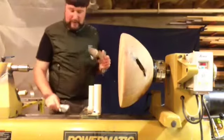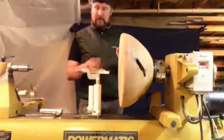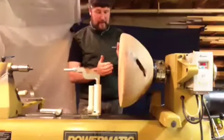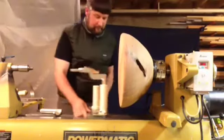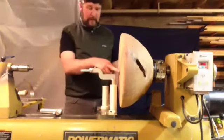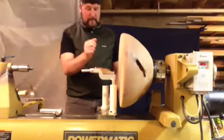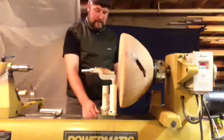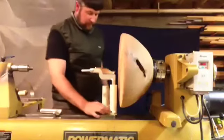So generally, since you have a sturdy tenon, it's best to start coring out the smaller bowls first, and the largest bowl last. What I've been doing is putting a 5/16 for the worm screw, so that when I get the center out, I can flip it around, redress the tenon, and then carve out the inside of the bowl.